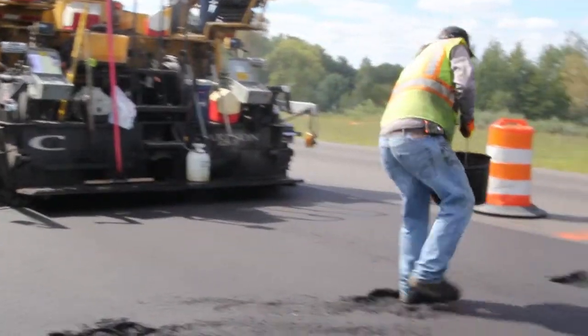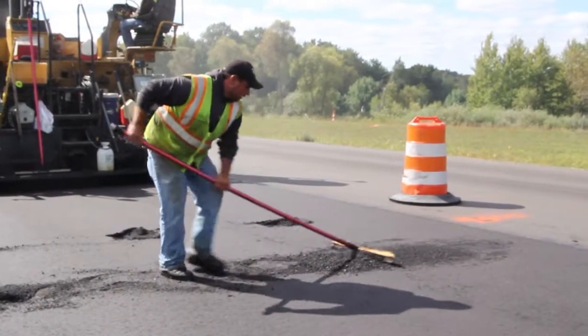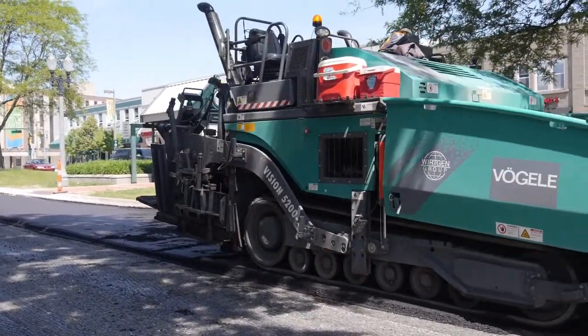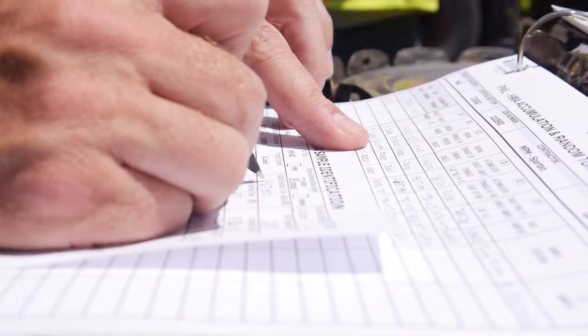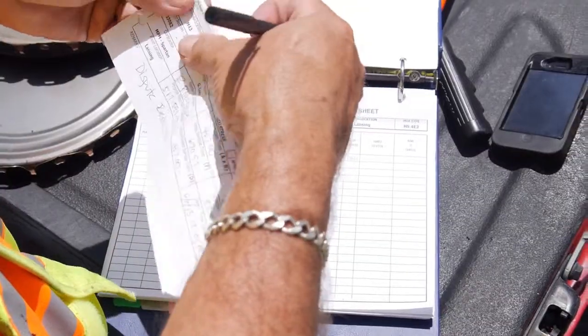The contractor will fill and level the void left in the pavement with HMA already obtained from the paver's auger system. Or the contractor may back the paver up over sample areas and pave over disturbed sampling areas. Once a sample has been obtained, be sure to fill out the form titled Sample Identification for HMA Mixture Street Samples and place the form with the appropriate sample.